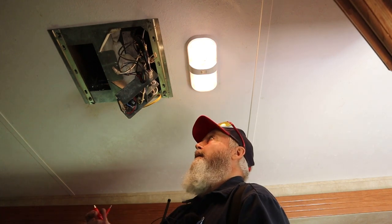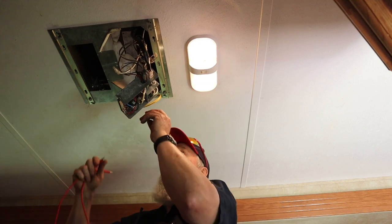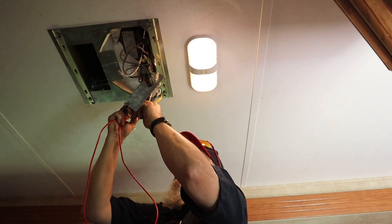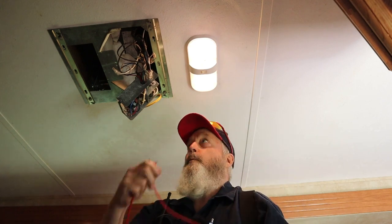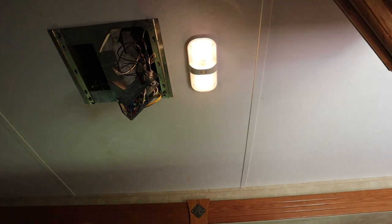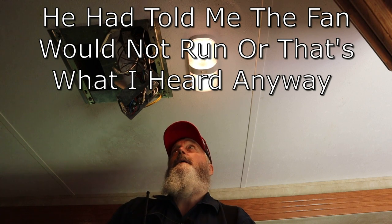We've got that box down. Now we've got to get all these screws out of it so we can access the guts of it. We know the compressor runs because we can hear it running. So I'm actually going to unplug the compressor for right now, right out of the relay, and cut the power back on. I'm going to use a jump wire to see if the fan will even run. Customer didn't inform me that the fan would actually run. So we're actually just going to change out this control box.